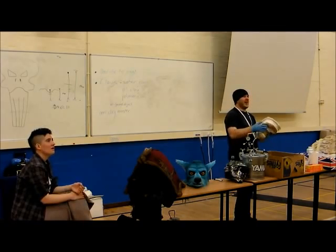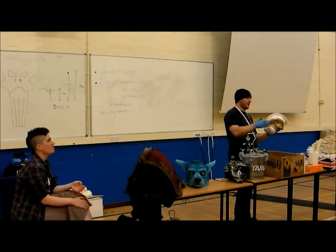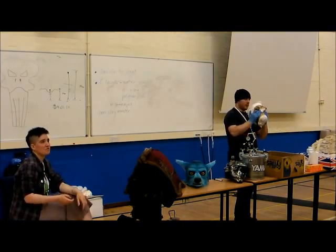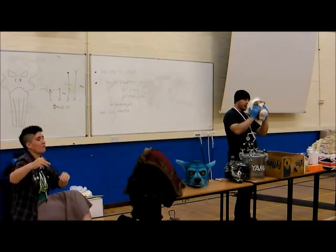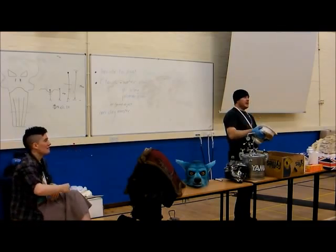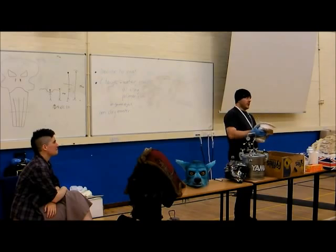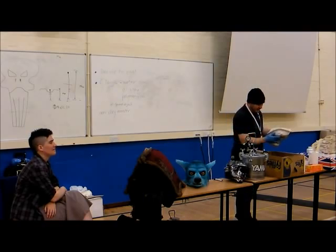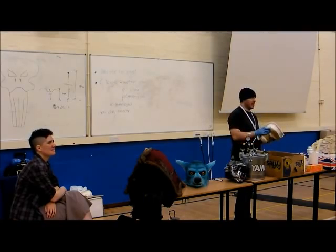I do it in a garage, which is a workshop. You do it with the door open. We've got a big 16-inch pedestal fan that we put behind us blowing out. Basically, no precaution is too much with polyester. Or indeed with fiberglass itself, because it's chopped glass. If you can do the stuff in a hazmat suit, because you've got a hazmat suit kicking around, do that.